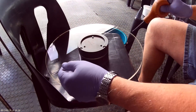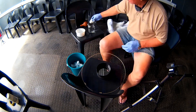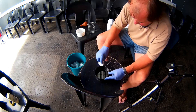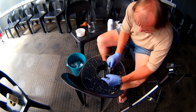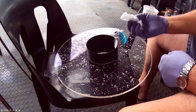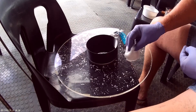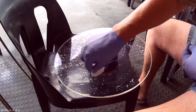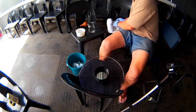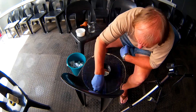This is the side we half-cleaned; the other side is quite dirty. The secondary does not look too bad so I'm not going to touch it. Now we can use a bit more water since there isn't anything that can get wet. Go over to the soap immediately. What is nice is you can turn the whole plate. Once it's wet and no dirt is coming off, take the cotton wool and drag it under its own weight. The soap is a very mild solution of sodium lauryl sulfate — you can use ordinary dishwashing soap, just one or two drops. Do not turn the cotton wool over; just throw it away.